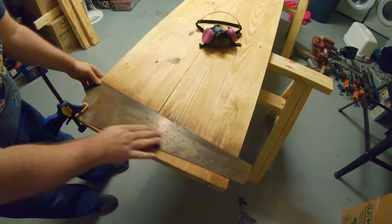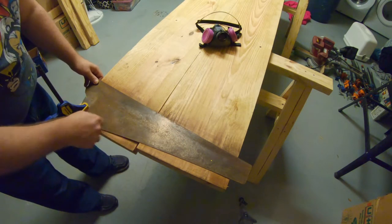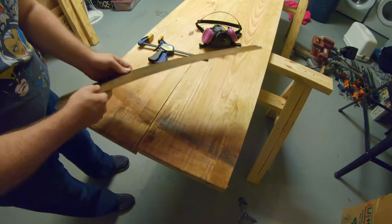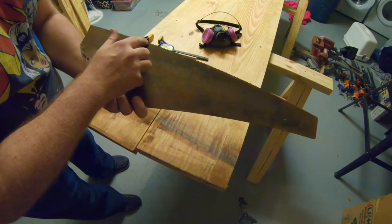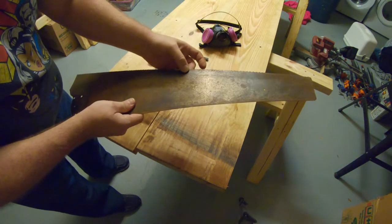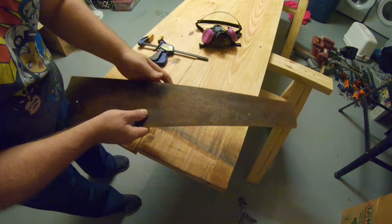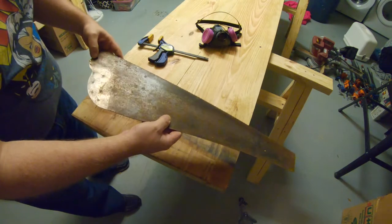We've scraped away any of the major scale - honestly this side wasn't the worst, the other side was worse and I already did that. If there's any major pitting going on then this saw was probably no good, as it damages the integrity and stiffness of the metal. You also want to look at each tooth very carefully and make sure there are no missing teeth and no cracks in the plate itself. A cracked plate is going to end up breaking on you, and missing teeth are a pain to file the entire thing down and restore.